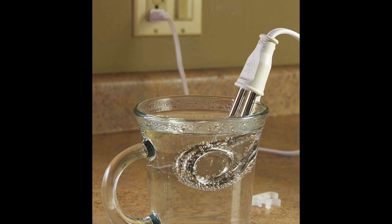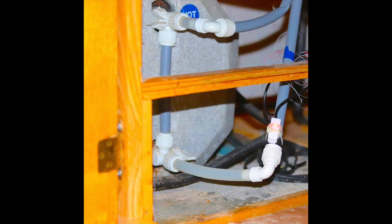And you can see a photo here. This photo shows the actual RV water heater. The lower hose is the freshwater inlet and the upper hose distributes hot water to the RV. So we need an alarm when the water inlet hose ever becomes dry.